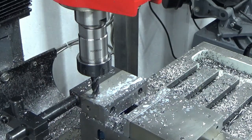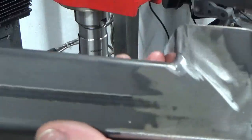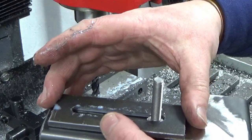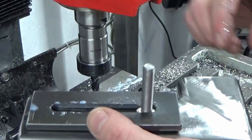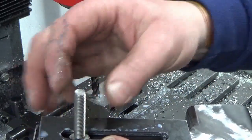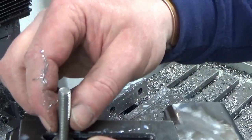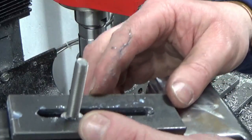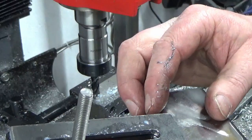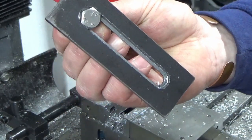Once all that's put together, we're going to go back to our extraction spout, and basically we're going to weld this onto the side of the extraction spout, and that stainless nut will be permanently captive. I'm not going to weld it, I'm just going to tack it in four places probably, and that stainless bolt will then be permanently captive in there to slide up and down, but it can't spin obviously. So next job is just modify this hex head.